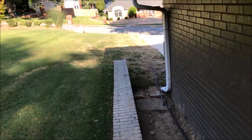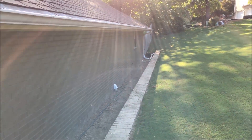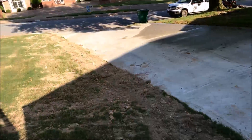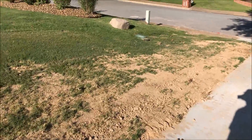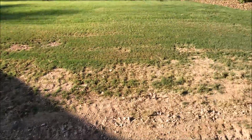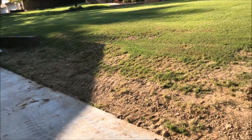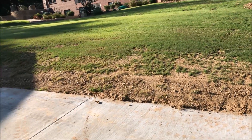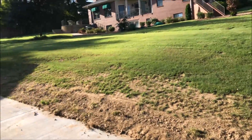Pretty much all done with this job — actually I finished it a day or two ago. I maintain this property, so I had to come back out to put a little topsoil down. This is why I like to use a Mini-X on this job: it's not perfect, but it's a lot better than using a trencher, because using the Mini-X lets you pull all that dirt back into your trench and then just grade it over. That Bermuda grass this time of year will grow right back through there. Throw a little straw in there just in case it rains so your dirt doesn't run down the road. Other than that, they are good to go and we're done here. Thanks for watching — any questions or comments, leave them below.